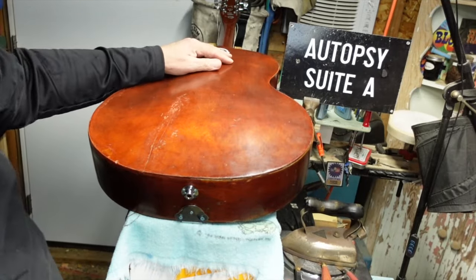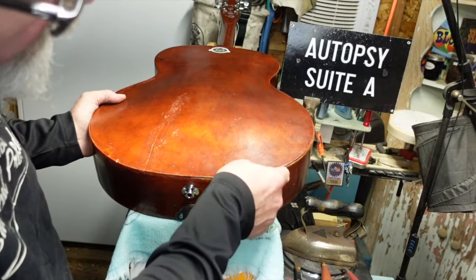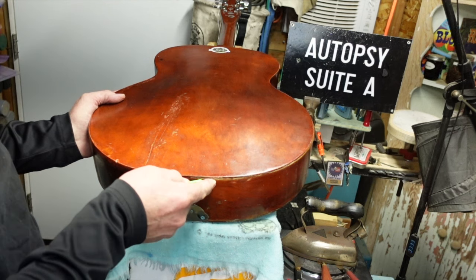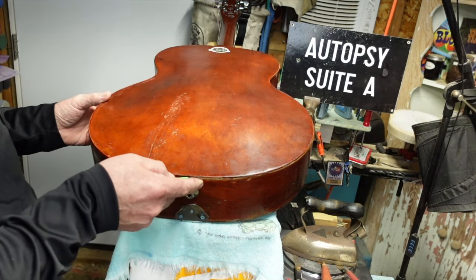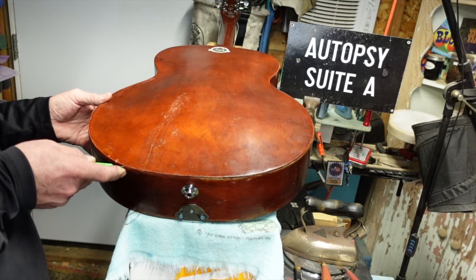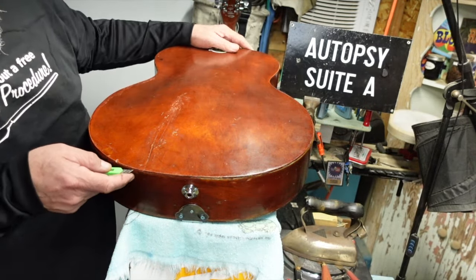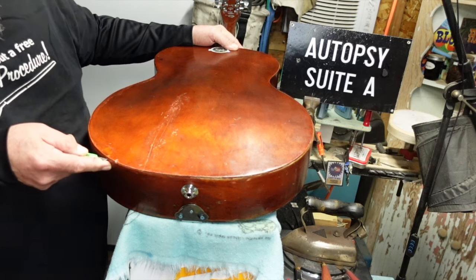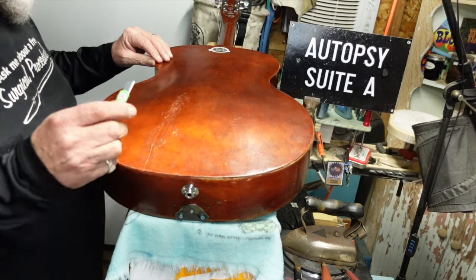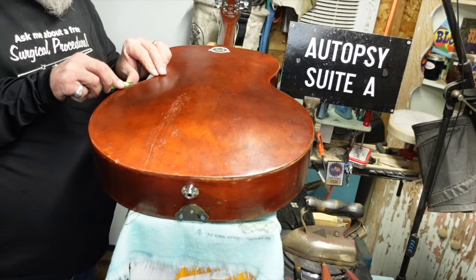Okay, so the first thing that we're going to do is take a razor knife and carefully go along the edge where we glued this up before. And I want you to remember that we used hide glue. We're going to be glad that we did, because Titebond, especially Titebond 2, is not going to want to cut loose. And you'll remember that when we patch this stuff, there's cleats in here, there's kerfing under here. So when we start using palette knives, we want to make sure that the knives we use aren't burrowing way back in here very far, because you'll cut your kerfing loose, and the next thing you know, the whole thing is coming undone worse than it could be.